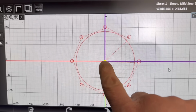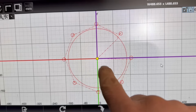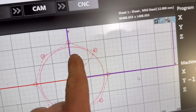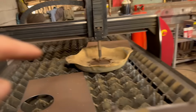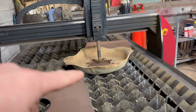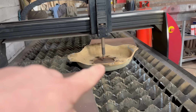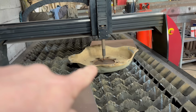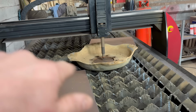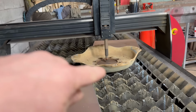And then I've got that set up to start from the middle and then cut the holes out and then cut the middle out. When it comes to cutting the centre out, I might have to turn the torch control off, because when it comes to one of them holes, the original bolt holes, there's no steel to cut, so it tries to lower the torch, thinking that the steel is lower, even though there's none there. And then it'll probably catch, and I don't want it to move the rim if it lowers when it goes over a hole and puts the torch into the hole.